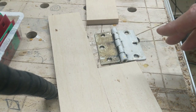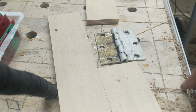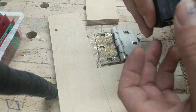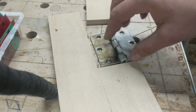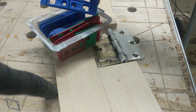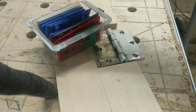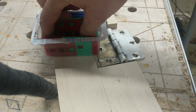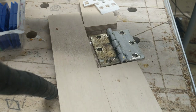We're going to make this so that if you want to rout the hinge on an existing door jamb with a doorstop installed, it'll sit over top of a half-inch doorstop as well. The first thing you're going to do is throw your tape measure away, because measuring stuff is the first way to get it wrong. You don't need to measure this — you're going to use the actual hinge itself and some pre-made marked spacers. This one is a quarter-inch, this one is one-eighth — that's what we're going to be using. This makes it super easy to give you an offset of what you're going to make. Then we're going to need some CA glue, hardener, wood glue, and some scraps of half-inch Baltic birch.